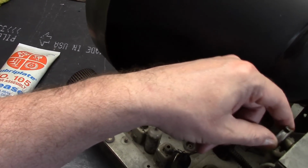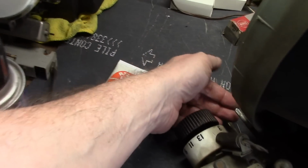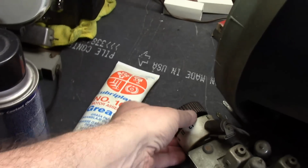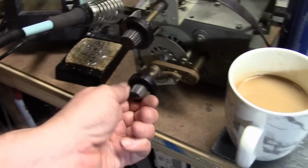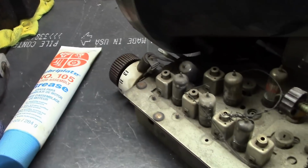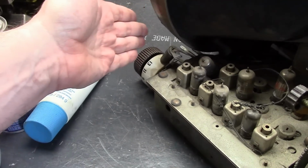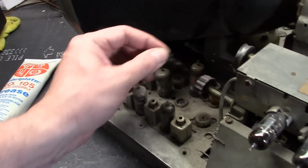It's up here, and it should go down to a pulley down there, and it's actually a control behind a panel, I think, on the front. This is the fine tuning control. It's not around the channel clunker, which is how you normally would do it. For example, here's an RCA set, channel clunker, here's the fine tuning. That's normal. This is not normal. I think the thinking is, if it's set up properly, you shouldn't need to get at the fine tuning control. So they made it somewhat inaccessible, and then the pulley arrangement. Boy, I hate dial stringing, but I'm going to have to deal with it.